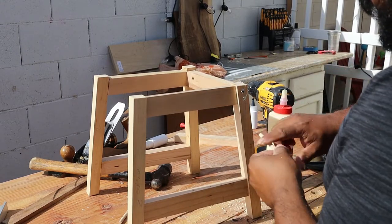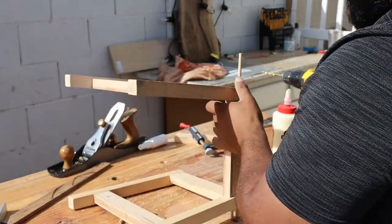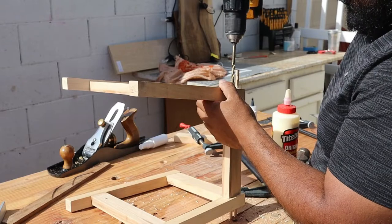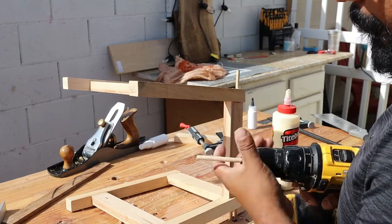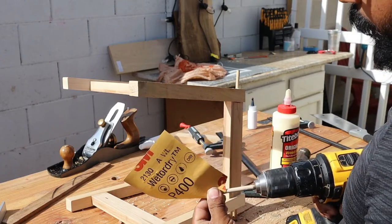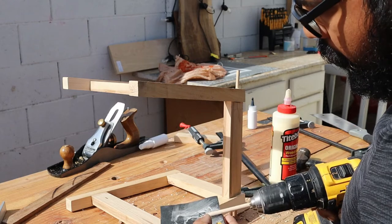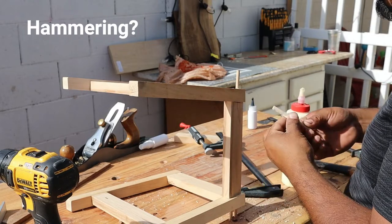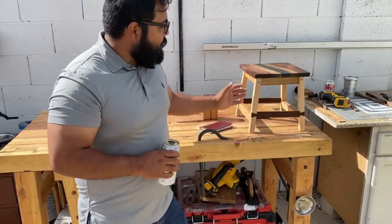I'm gluing the hole, the dowel, and the piece of maple. The maple I used for the stool was a giant piece my father-in-law had in his shed for a decade. I think it's pretty romantic that a piece of this stool was waiting for my daughter for a decade. I sanded the body just a little bit at 400 grit — 220 would take off too much too fast. I tapered the tips and hammered in all of them, two on one face and four on another. Joinery is hard.